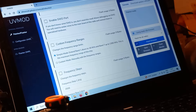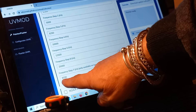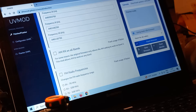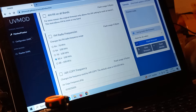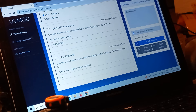'Custom frequency ranges' - this is the one everyone's interested in: 18 MHz up to 1.3 GHz, tick that box. Frequency steps: one complaint was for the air band you didn't have the 8.33 kHz step, which made the air band more intelligible. NOAA frequencies - more USA, I'm not interested in those. 'AM receive on all bands' - handy if you're going into 27 MHz and want to listen on AM. FM radio frequencies, air copy frequency, LCD contrast.